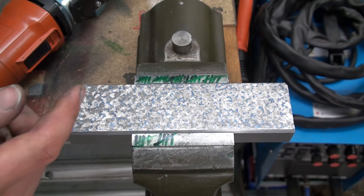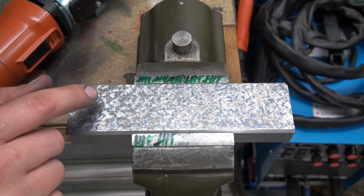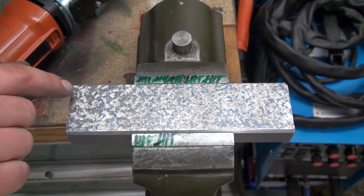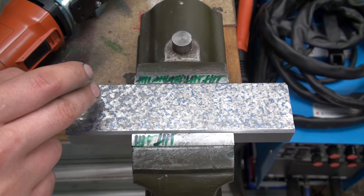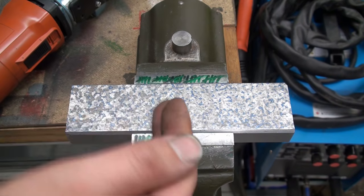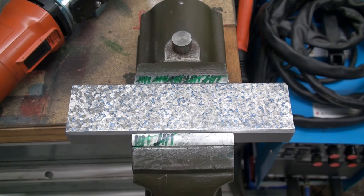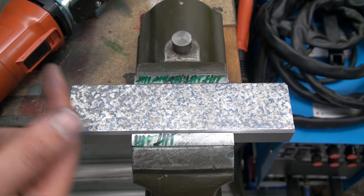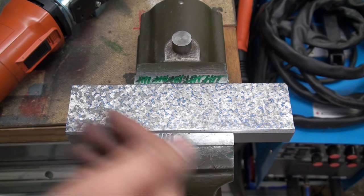Mr. Richard King wrote that to get a nice even pattern, each scraping mark should be individual. It shouldn't connect to each other, though. For example, you make a scrape mark every 10 millimeters if there is a high spot. If there is no high spot, you don't make a scraping mark. But if there is a high spot, you make a scraping mark and you go every 10 millimeters over the surface. And in the spots between your scraping marks, if there are still high spots, you come in at 90 degrees in the same path and clean that up, and that gives you somewhat of a pattern.